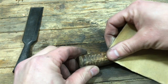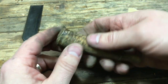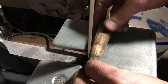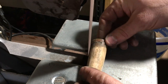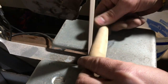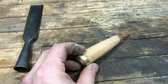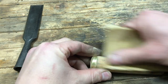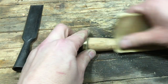Next was the handle. The handle on this was kind of beat up and the brass ring was uneven. I knew I wanted to clean it up, so I took it to the belt sander first to clean off the old varnish or oil finish, and maybe a patina that had developed on there, so I could refinish it. I polished up that brass, then sanded it first with 120 grit and then with 220 grit until it was nice and smooth.